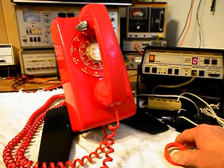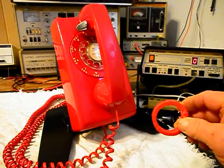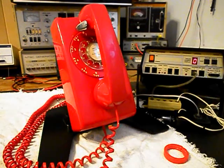We also want to mention our amplified pickup. We use this in troubleshooting, repairing, and on our final checkouts. It's amplified so that you can hear the audio from a receiver. And I have an amplifier back by the video. It has a button on it. When I press the button, I can give dial tone or take it away at any time. And since it's an open amplifier, it is prone to any static interference or noise in the atmosphere.